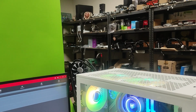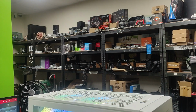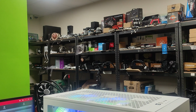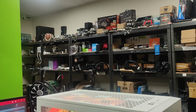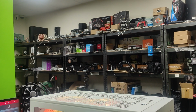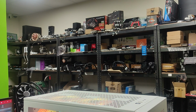Here's the thing, when you look here, you can tell me what's wrong immediately, because here we have 1, 2, 3, 4, 5, 6, 7, 8, 9, maybe 9, probably 10 or 11 Corsair water coolers here. They're all failed. Every single one of those had some blockage in them, or maybe degradation of the ring, the seal. It's nearly always the seal.